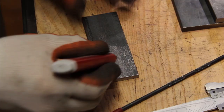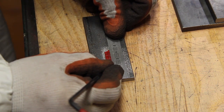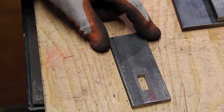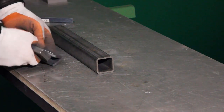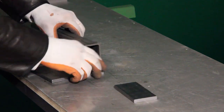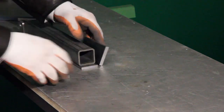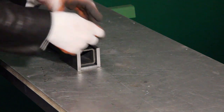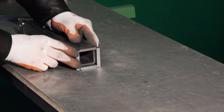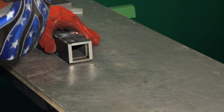These parts will form the base of the arm that will hold the seat of the angle grinder. The elongated hole is used to move the arm up and down, and these parts are required to fit perfectly the square tube used as the arm that will hold the angle grinder. Once I put the parts together, I realized there was an excessive step on the top side, so I put an L-shaped piece of steel as a shim. As you can see, the square tube slides perfectly inside the newly built base.